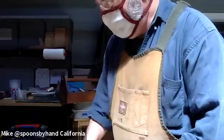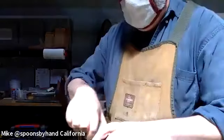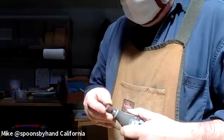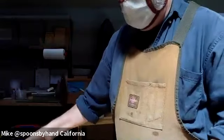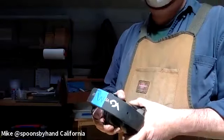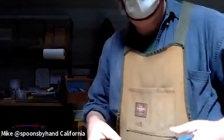When you ground away that bevel, were you pretty much just touching the Dremel down right on the bevel, or were you doing it in a couple of different lines? I was trying to leave the Sharpie marker black right at the bevel till the very, very end. So I was trying to not actually touch the cutting edge. Gotcha. So you did sharpen everything. The cutting edge is already okay. It's everything immediately past the cutting edge that you need to deal with. Gotcha. All right, so I'm going to mute myself again,